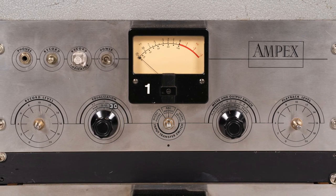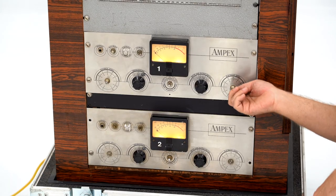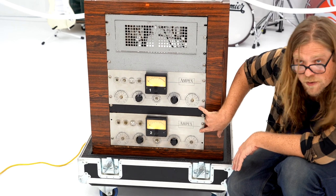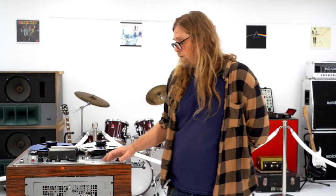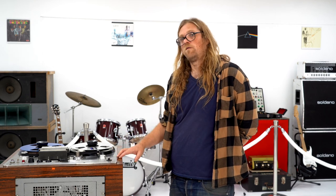The original owner removed the input and playback alignment knobs. It's so tempting to come over and fiddle with them, but these need to be manipulated so infrequently that it's good protection in the studio to just have the knobs off. You could record something on this and have it played back on a Studer 827 and vice versa. These machines initially ran at 7.5 and 15 ips, which aren't speeds widely utilized today — 30 ips is what most people use for a half-inch print down.